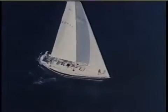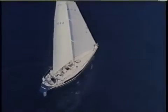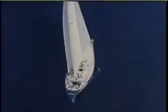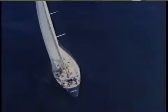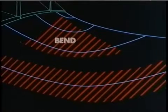The amount of draft and position of maximum draft are crucial to a sail's performance. Changing them is the basis of shaping the sail for all the different conditions you'll encounter on the racecourse. The primary means of adjusting the draft of a mainsail is mast bend. By bending the mast, we pull the luff of the sail forward, away from the leech, thereby flattening the sail. Mast bend controls fullness in the upper two-thirds of the sail, and the outhaul serves the same function in the bottom third.